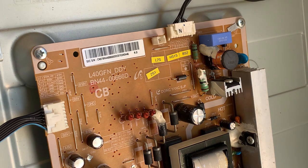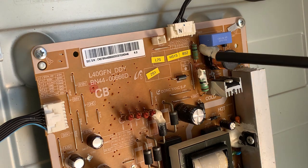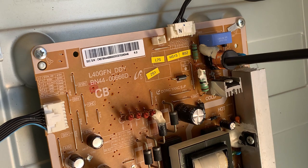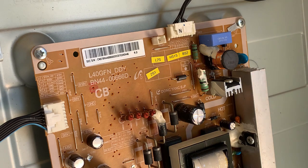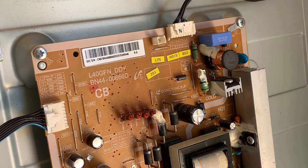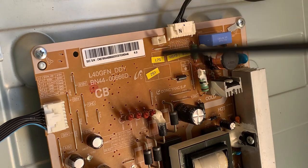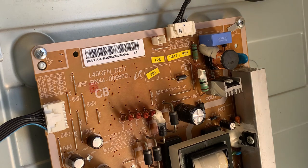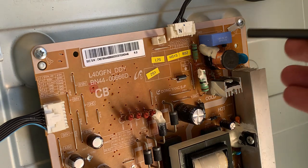We have an inductor here. Our inductor will serve to control the ripple. Remember, looking at this layout, we are dealing with a constant current supply. So to store that current, that is what that inductor is for. An inductor doesn't like to see a change in current flow. So an inductor does to current what a capacitor does to voltage. Remember, a capacitor doesn't like to see a change in DC voltage. So if the voltage peaks, the capacitor will store it, and in the trough period, the capacitor will release that charge. The inductor does the same thing, only for current.